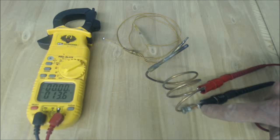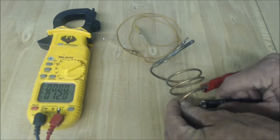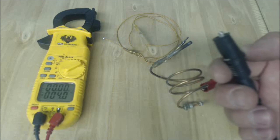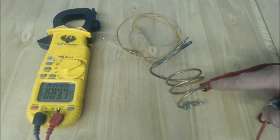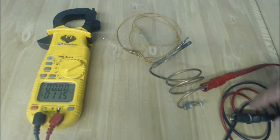If it was connected and this part was actually connected to the gas valve, then what you'd do is take this part off right here, and on the back of the gas valve a lot of times there's a little pin that you can read the voltage off of. You leave one lead on and read the other on the back pin of the gas valve.